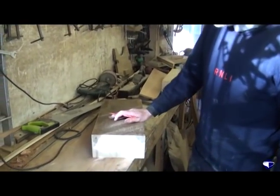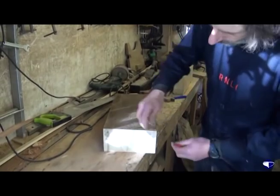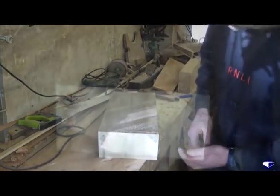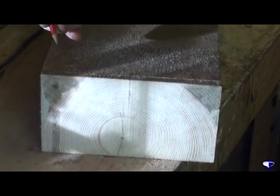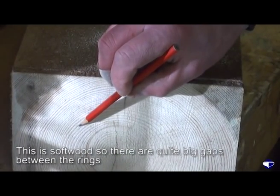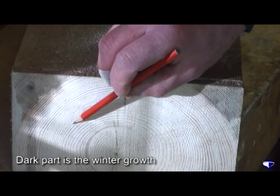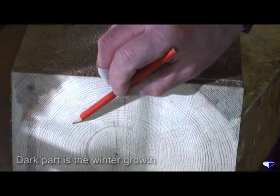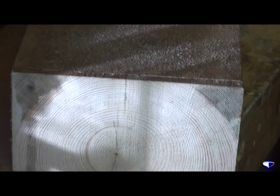This is just a section of a biggish bulk of timber, just really to show you what a tree looks like. You end up with the very centre of the tree and then the rings spreading out from the centre. Right out here is the sap wood — this is soft wood, so there are quite big gaps between the rings. The dark part of the ring is the winter growth and the paler bit is the summer growth, so there's a lot more summer growth than winter growth.